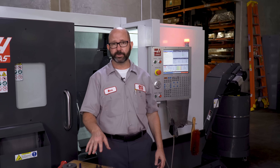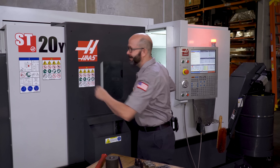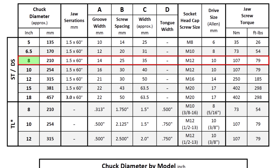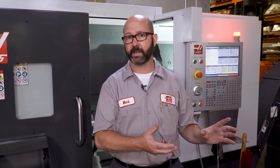In order for our screws to do their job properly, they need to be torqued to the right value. Looking on our chart, we know that an ST-20Y with an eight-inch chuck should have M12 bolts, should use a 10 millimeter Allen, and we should torque those jaws to 79 foot-pounds, or 107 newton meters. The best way to make sure that we have the correct torque value is just to keep our chuck from spinning and use a torque wrench. If your lathe is equipped with a spindle brake, we could use an M14 to turn that brake on and M15 to turn it off.